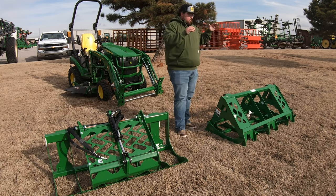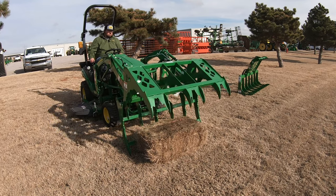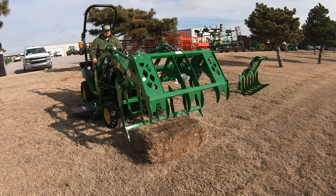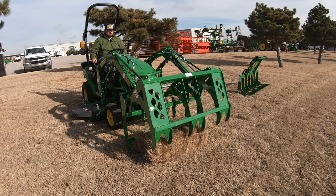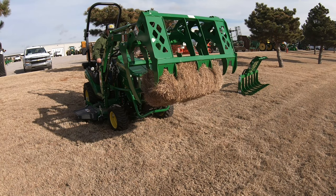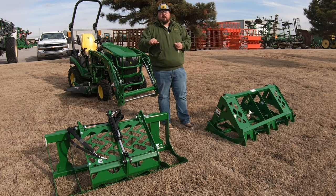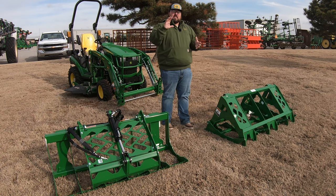Now, here with the mechanical grapple, this is going to be a little bit different, because whenever you are using one of these mechanical grapples, it is constantly open until you start to use the curl function on your loader. So instead of using that hydraulic grapple, what you're using to close the mechanical grapple is going to be either your curl or dump function on your loader. So if I was ready to close the grapple on this mechanical grapple, what I'm going to do is hit my loader